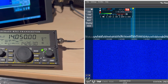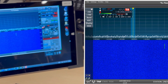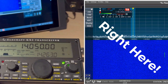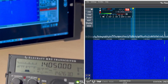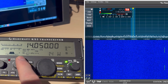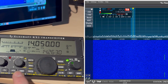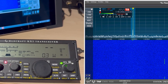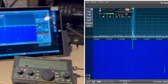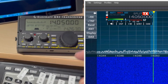Let's run this experiment. I've got my KX2 right here, and the Flex Radio is back there with the computer running the software — I'm recording the screen so I don't need the camera for that. I'm going to adjust the power to 0.3 watts, then hold the button down to tune. We're transmitting into the dummy load, and on screen you can see we're at S7. That's S7 at 0.3 watts.